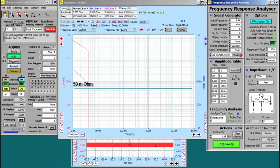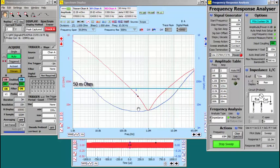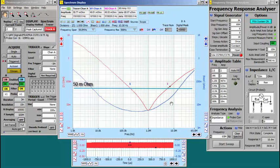We're going from 1 kilohertz up to 65 megahertz with 6 volts peak to peak input and a 0.75 ohm reference resistor. We're measuring impedance. Right, looking for the 50 milliohm point, it's about here. That'll do. I'll make a marker there, and at the opposite side, the 50 milliohms about here. So we've got a frequency range of around 187 kHz up to 5.7 megahertz.